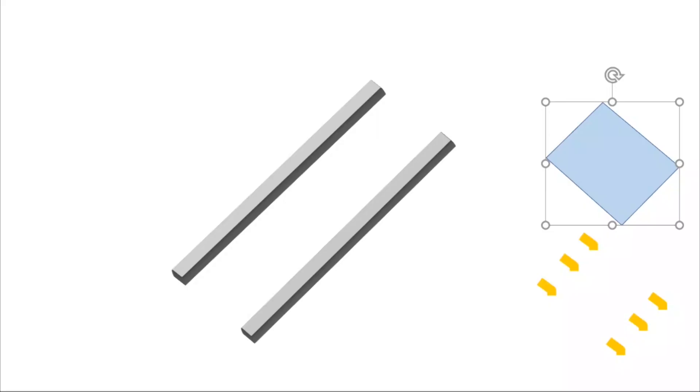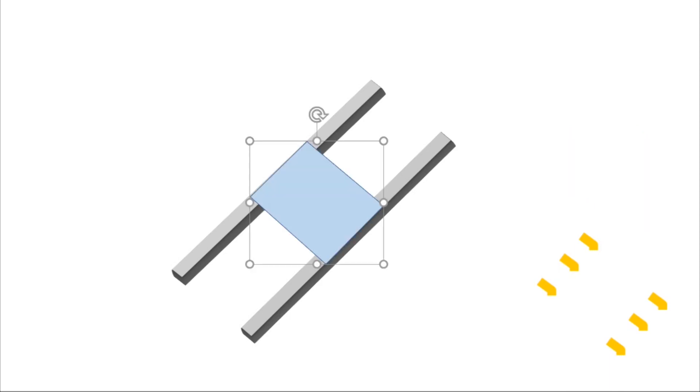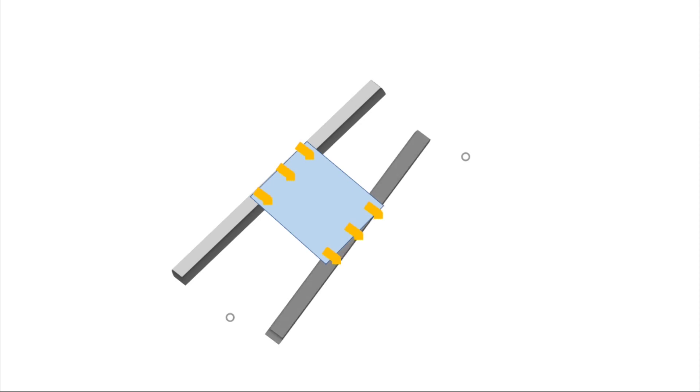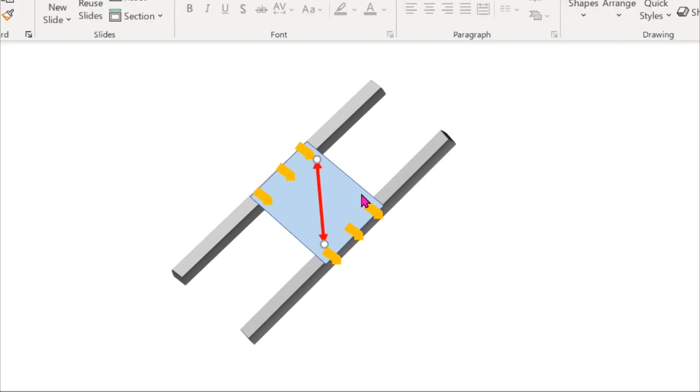With this doubled-up deck and also six lashings, I believe this design would work fine in calm water. But in rough water, there are other dynamic motions being applied to the pontoons. The pontoon by itself is flat, therefore the twist motion can be easily contained, but the sideway swinging of the pontoon means the deck has to be strong to prevent it from twisting and folding.